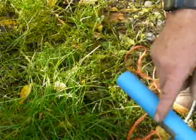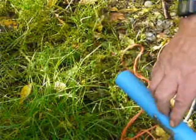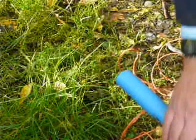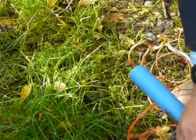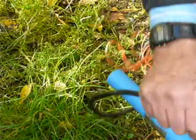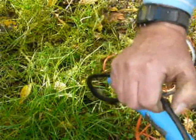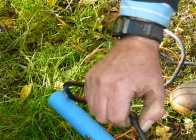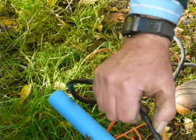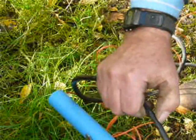This is perfect for conduit when you want big fat cables to go across a lawn or some area like that across to your solar panels. The conduit will keep the cables dry because you've got DC coming through. If there's any dampness, any imperfection in the cable will start creating electrolysis, and I have known cables to rot away completely over time — even though they're copper.